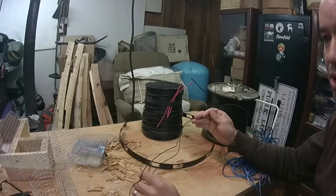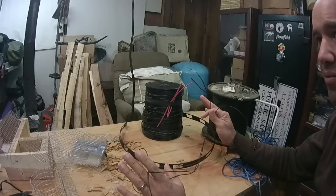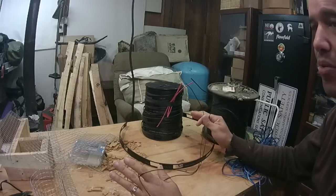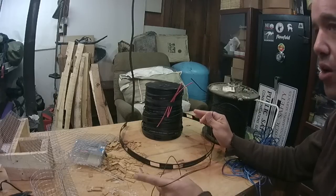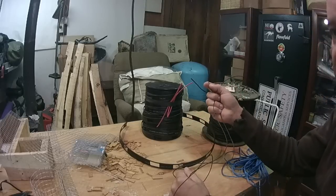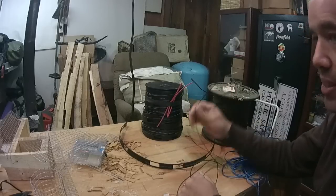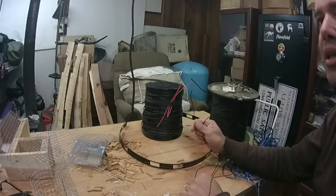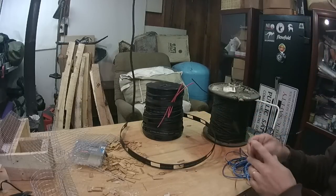You could use copper wire or aluminum wire, but copper is malleable — it starts to stretch. If that wire stretches, it's going to change the resonant frequency of your antenna. Making it longer tunes it lower in frequency than your desired frequency. This wire more than likely won't stretch because of the steel in it. I'll deploy it semi-permanently in my yard and check up on it periodically — it's going to be an ongoing process.